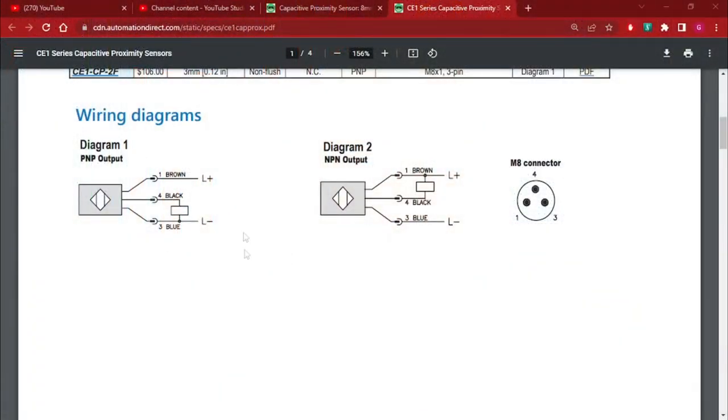That's it — you just have three wires. Let's just kind of review that real fast. Three wires — that's your typical. There are some that just have two, but you would test it the same way: have it on reference and see that the signal changed state. It's just three wires — you've got your power wires and then you've got your signal. What that box represents is your load, whatever load you're going to. A PLC input can be a load — it is a load. Electrically speaking, that's it. Power and signal. Make sure you're on the right reference — reference, reference, reference. If you've been to any one of my classes, you'll hear me say that so many times you'll be sick of it.